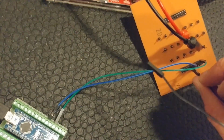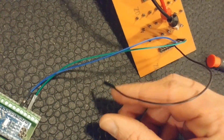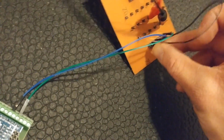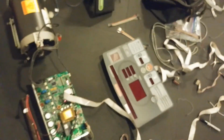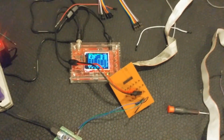And then I found that we need to have another pin drawn high. And that's just this guy right here. Normally, the control panel draws this pin high. So now that we've done this, we'll begin putting up the square wave in just a sec. And we power the VFD on. There we go. And again, it's just kind of stumbling through it to figure it out. But sure enough, that's the ticket.